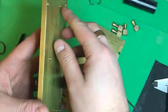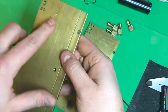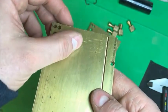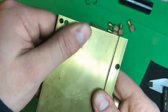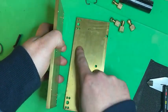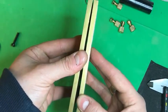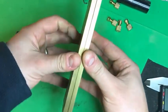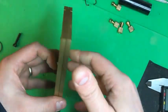Basically, these are pins — little taper pins. You drill through and hammer them all the way home. You can see that edge sticking up there; I've just literally snipped that end off with some pliers. But actually what you can do is polish that up and make those literally invisible, so you won't be able to see them. What they're used for is — you've got the holes on the other side which match. It allows the two parts to meet together absolutely perfectly, so I can't move them — there's no movement in them whatsoever.